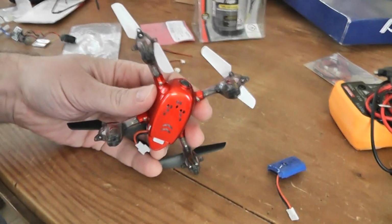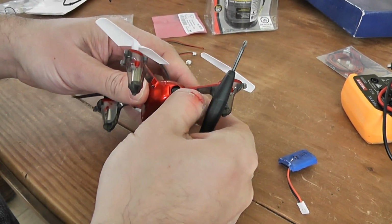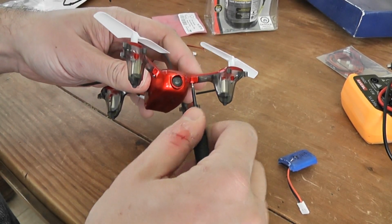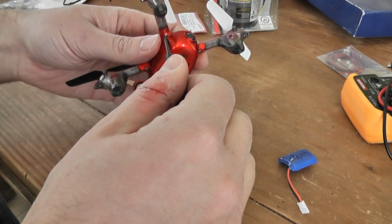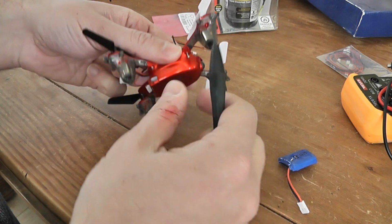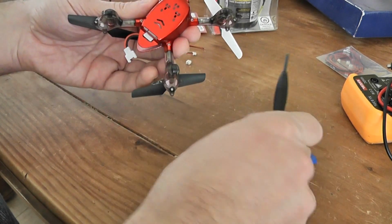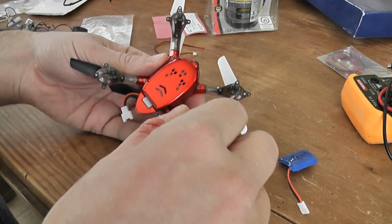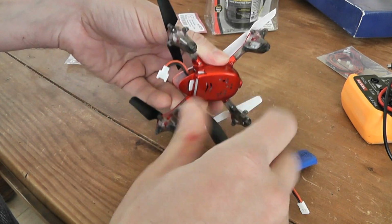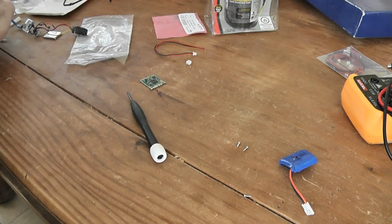I studied several solutions to install the video transmitter, but I guess I will take the simplest one, to install it in the actual free place of the X11C version. So you have free space to install the camera of the C version, but I will use this extra free space to install the video transmitter and the voltage regulator. So only 2 screws. Be aware to not lose them. Use a tweezer.